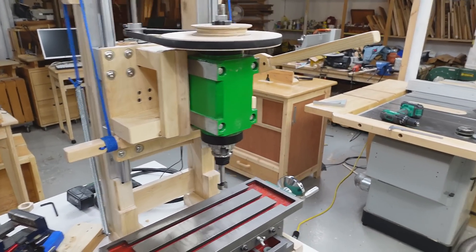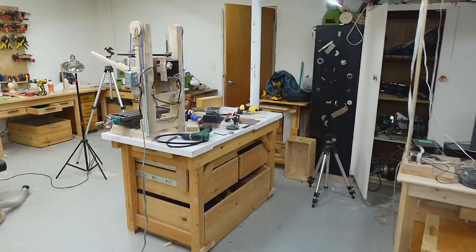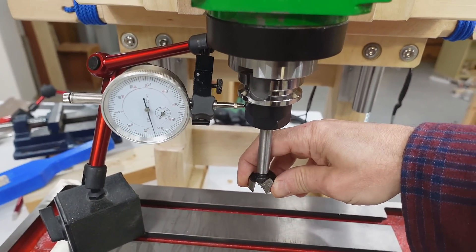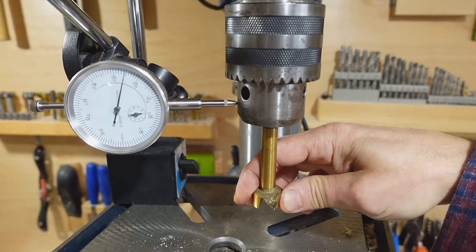I think I can say that this thing cuts steel about as well as my mini lathe will — in that it will cut steel, but vibrates a lot. So does my milling machine. But compared to a drill press, I think it's quite good. If I try to wiggle the bit, I get about 0.1mm deflection on a metric dial indicator. On my drill press, it just has play in it. As I was working on it, at some point I totaled up how much I spent on all the parts, and I was getting close to the cost of a mini mill, not counting shipping or taxes. I thought, I don't actually need a mini mill, so why am I building this thing? Well, I just wanted to see if I could do it, and I think it'll still be useful — but mostly it's all about trying to build it.